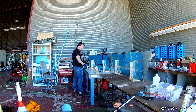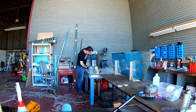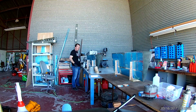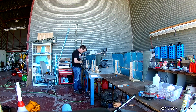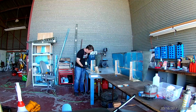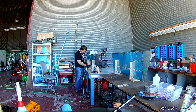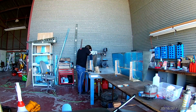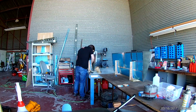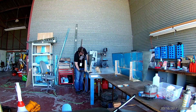Making sure I'm lined up with all the rivets. So I have a couple of sets of rivet gauges, which is a good thing, because once you put the nose ribs in and put that front spar on top of the nose ribs, anything that's in between those nose ribs pretty much gets trapped in there forever. And that's what I almost did with one of my rivet gauges — instead of pulling my arm out to grab the rivet gauge and put it back in, it was easier to just leave it down there, and I wound up almost leaving it in there while I was riveting it all up.